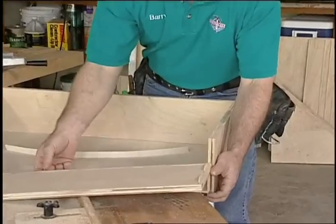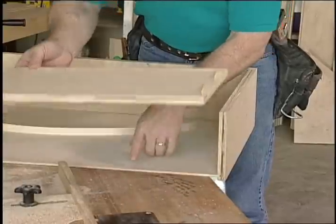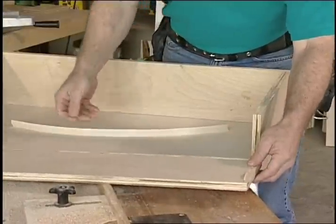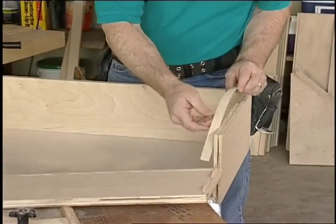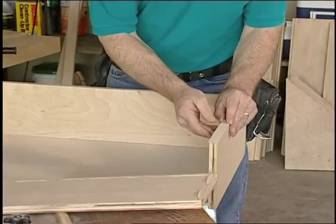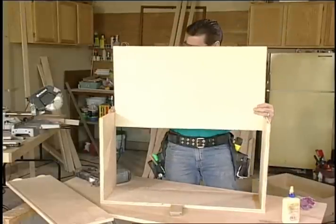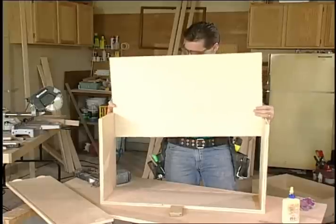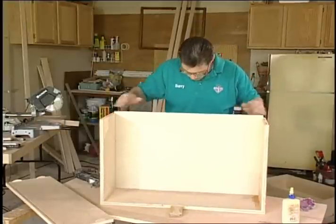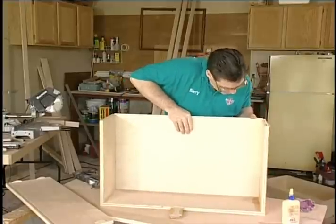The final step will be to cut a quarter-inch dado in the bottom of the drawer panel to receive the panel itself — a quarter-inch straight bit will cut that. Then, to give it a nice finished appearance, we're simply going to put birch edge banding on top of our birch plywood. Most quarter-inch plywoods actually measure closer to three-sixteenths, making them easy to slide into the quarter-inch dado.